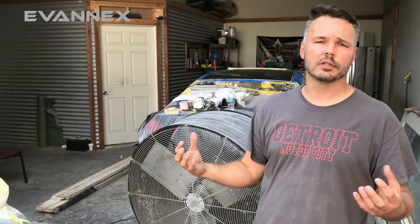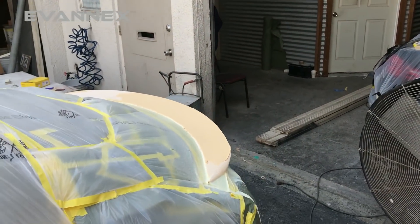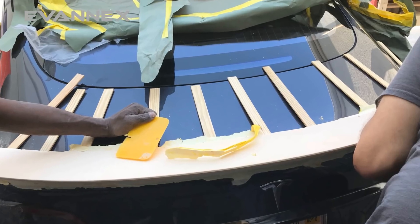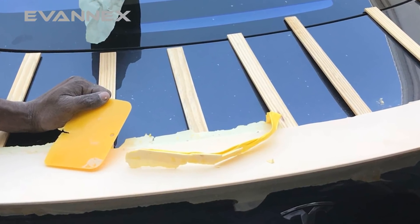What you're looking at now is our original foam plug coated with a chemical that allows us to work directly over it. It's got Bondo that we build up and reshape until it's exactly what we want. From there we'll get our shape set, remove it from the car, and start the mold manufacturing process — building a flange and a two-piece mold with an upper piece and a lower piece. When we make carbon fiber parts, as always, it's going to be 100% carbon fiber. It'll be bonded together, fit on top of the car, wet sanded, polished, and clear coated for UV protection, ready to roll. You should be able to install these out of the box with no additional modifications — no drilling through the deck lid — just 3M double-sided tape, and it'll stay in place for years to come.